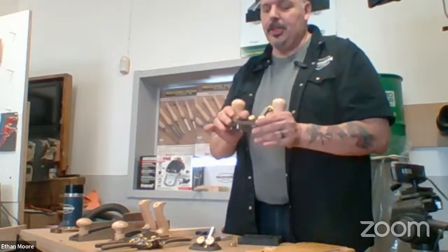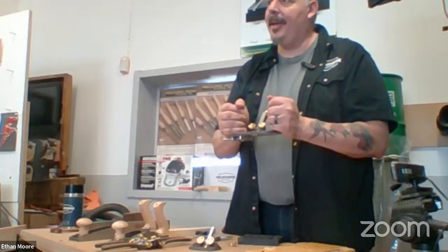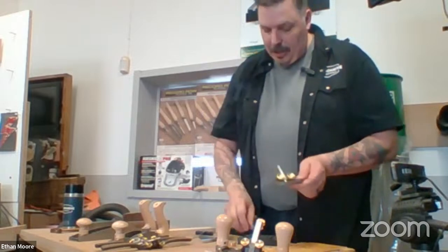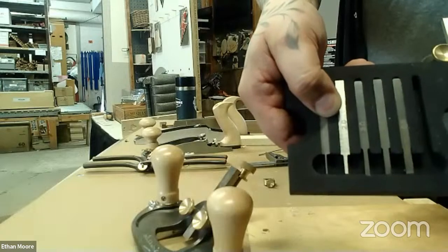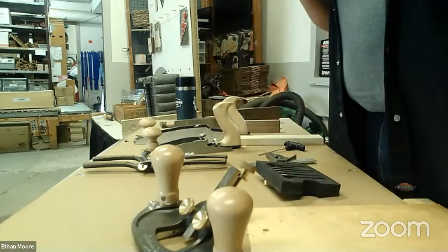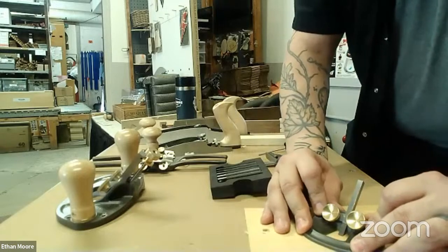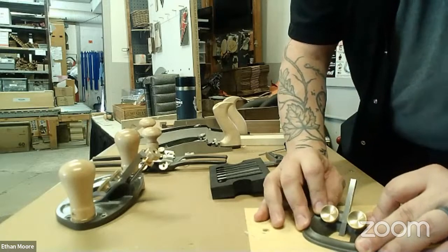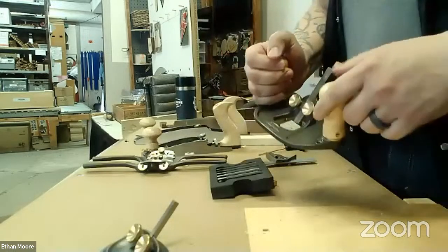When you buy the small plane, you get a 6mm blade — quarter-inch — then a half-inch, which is 12.7mm. You can choose to buy singles after that or buy them as a kit of five — usually with a discount when you buy the kit. Why would you choose one over the other? The large one is designed for a little bit heavier work — it has handles so you can kind of hang on with an all-around kung-fu grip. The smaller one is actually lovely for doing inlay work, especially when you strap in that little one-millimeter blade — it can do very detailed, delicate work.